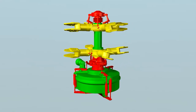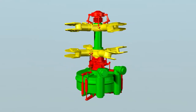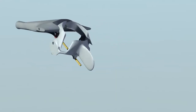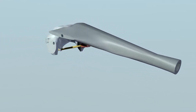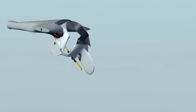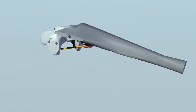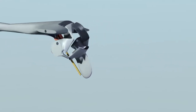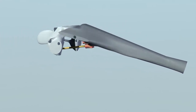Power input is provided by a pair of Rolls-Royce T800 big block turboshaft engines. The primary load carrying structure is a ring of hardpoints that encircle the gearbox. A second structure that we're calling a backbone is hinged to this primary structure and carries the tail boom loads and the fixed wing loads. A conversion actuator shown in red drives a screw jack between these two structures. A dual redundant electric actuator of sufficient power for all conversion flight loads was selected.